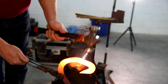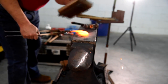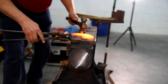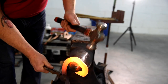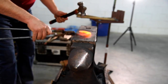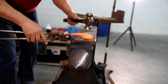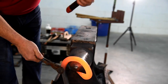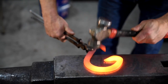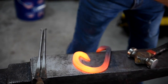So once we've got both halves set up and ready to go and everything is equal, everything's been turned the same, we're ready to turn the shoe. Obviously, if it's to a foot, you're making the shoe with that in mind to fit that foot. This is just a specimen hind heart bar, so we're just going to make a relatively symmetrical hind heart bar, and just to get it as equal as we can within the parameters of good shoemaking and balance. See how it turns out.